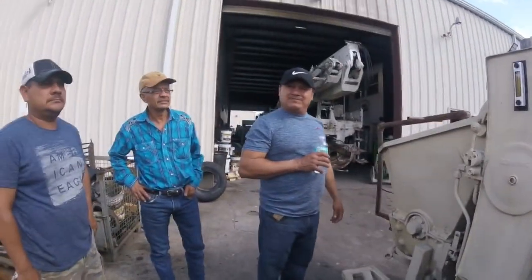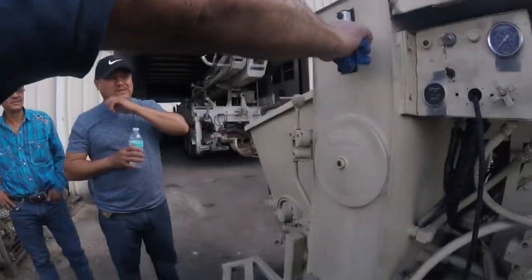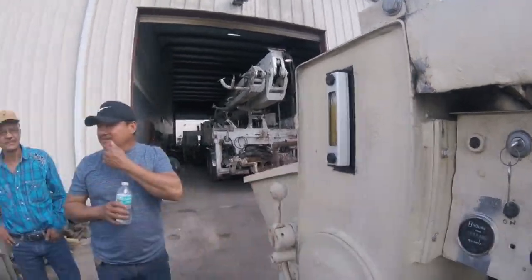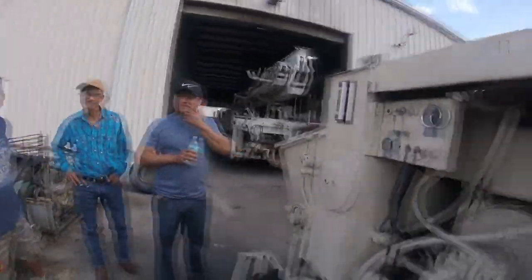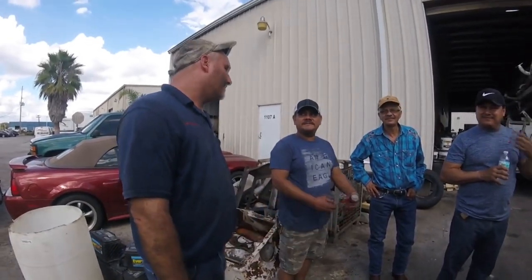As oil heats up, it expands. If you fill it all the way up, the first time it gets hot, it'll come right out the top. You say, oh, I got a problem. It's expanded. So that's the reason why the black mark is there. And then you got, in increments of 10, your temperature. So you should see about 135. In Texas, it might be 135, 140.